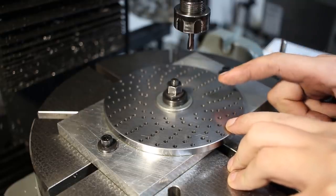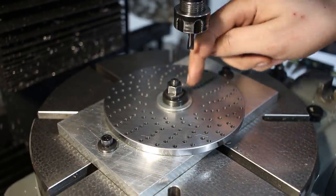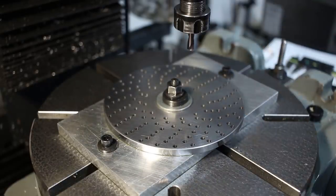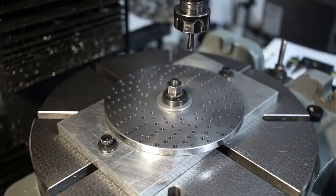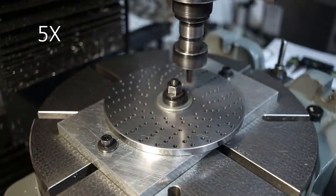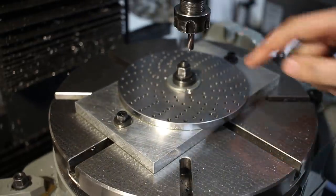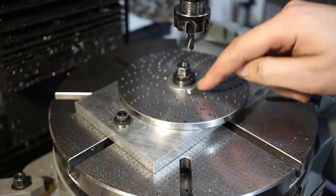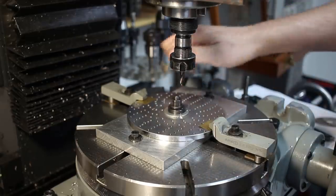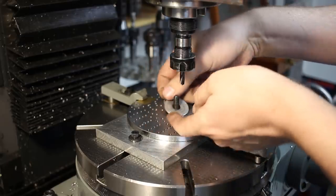All holes are drilled and bored with the single-point taper d-bit, all went well. The last thing to do is drill the three holes to mount the plate onto the dividing head. I could use the rotary table but that's a lot of hand cranking for three bolt holes, so I'm using the bolt hole circle function of the DRO and moving to hole positions using the XY table.